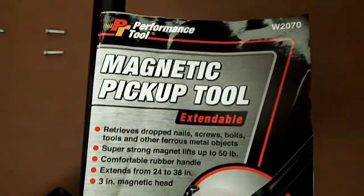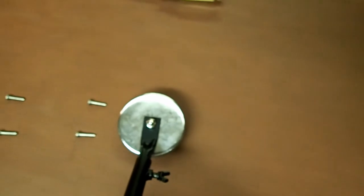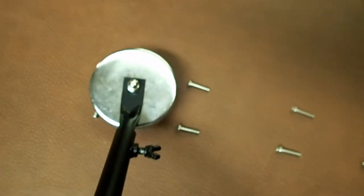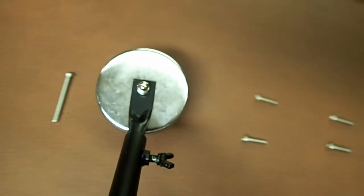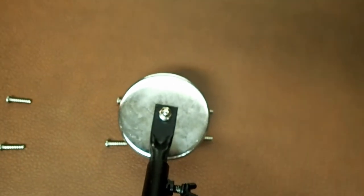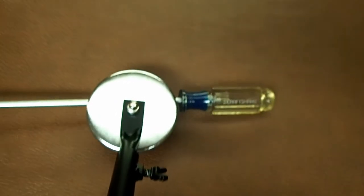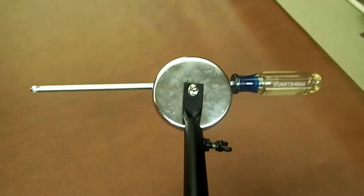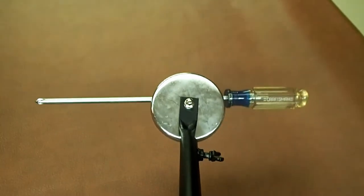To test that saltwater claim, I took the screws off of the trolling motor and ran them over a magnet — sure enough, they were stainless. If they were iron they would pop right up, as you can see here with my screwdriver. So the hardware is stainless. There's also a zinc anode that protects the propeller area, and after three years of use I have no rust on the trolling motor.